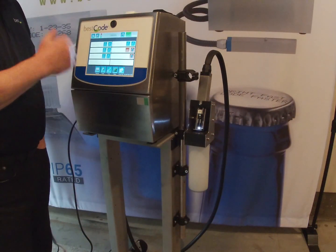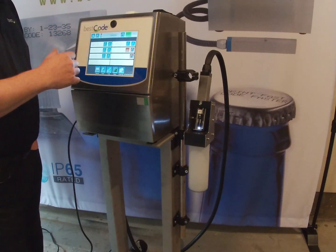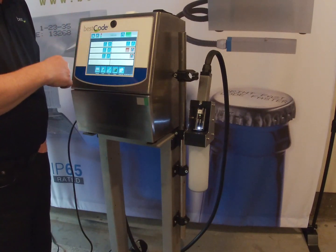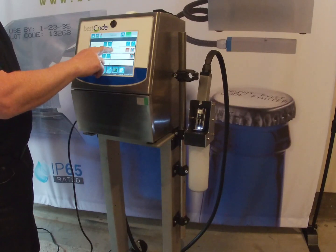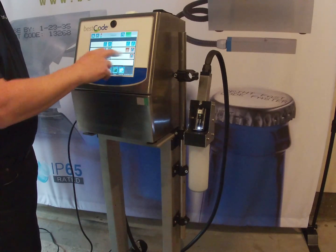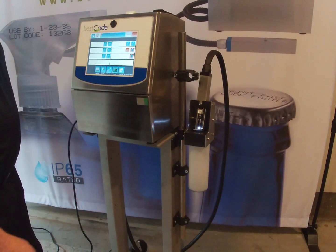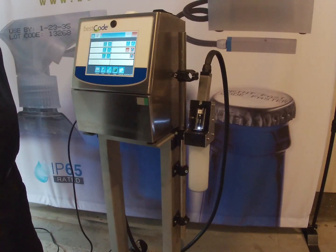So now we've run the slow pressure startup. We can go ahead now and hit the start button with full 40 psi pressure, knowing that we're not going to create any messes inside the printer with tubes coming off or leaks. So we're going to go ahead with the high voltage still disabled, errors off, and the phasing still disabled. I'm going to hit the green button at the top here. It says start, and you'll hear the jet start up and start its cycling, starting in 31 seconds.